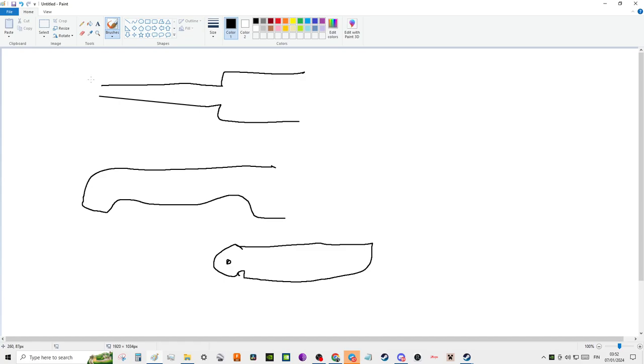And when it comes to rat tail tangs, we got these half tangs that go sort of halfway into the handle, so they don't go all the way through. A through tang will go all the way through, and then generally it is peened down. And the nice thing about that, of course, is you can push your handle material really nice and firm against the shoulder.